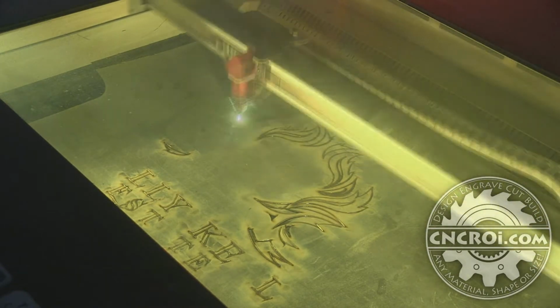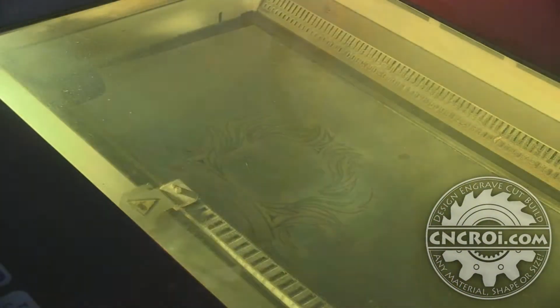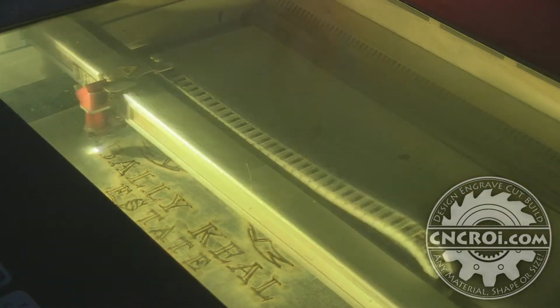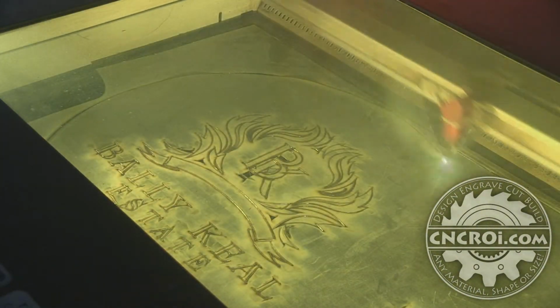If you make a stencil out of stainless steel, which of course we can do out of any material, the problem with that is curving it is a lot of trouble. Now polycarbonate, it's really easy to bend, and that'd be a great application for something where you want something very thin. The other nice thing about polycarbonate is you can actually see through it. It's optically clear, so when you take the masking off both sides, it's completely transparent to the eye, so you can definitely see right through it.